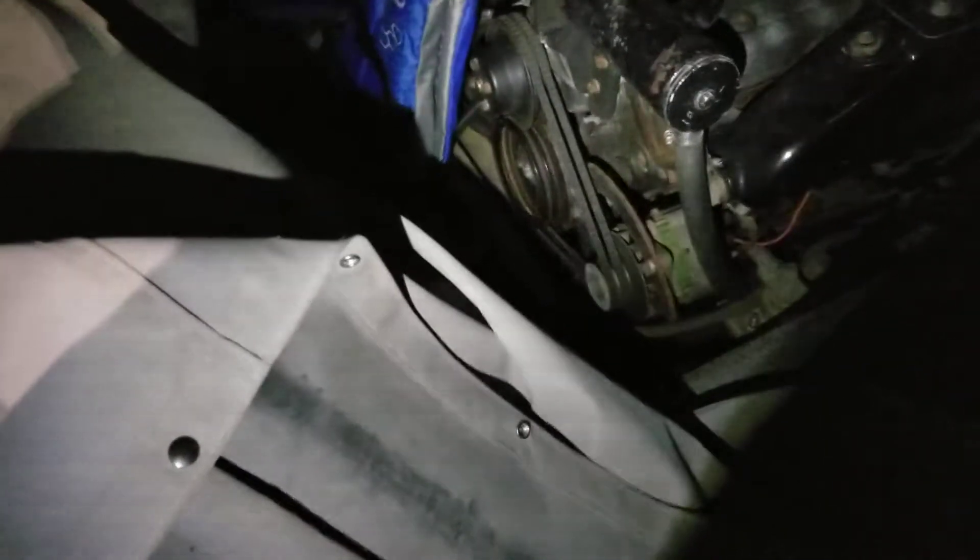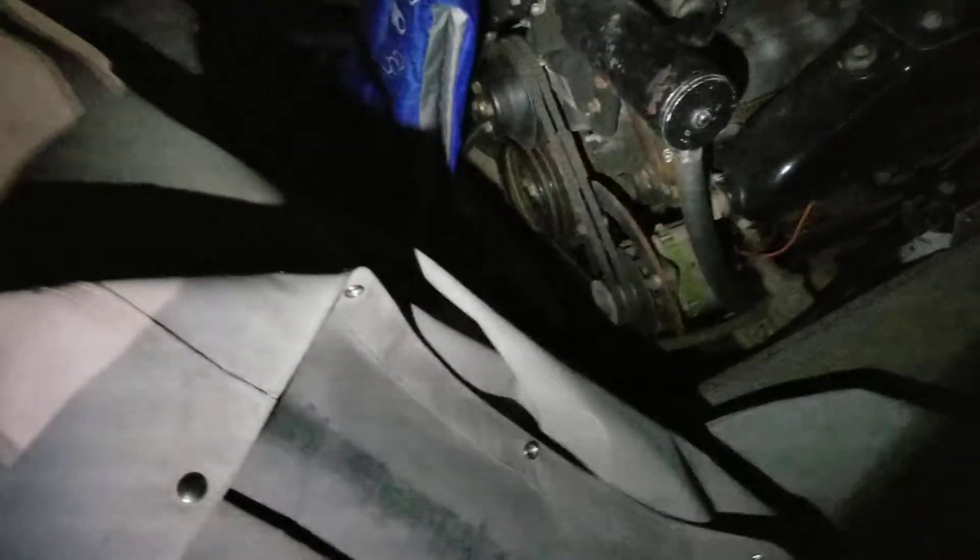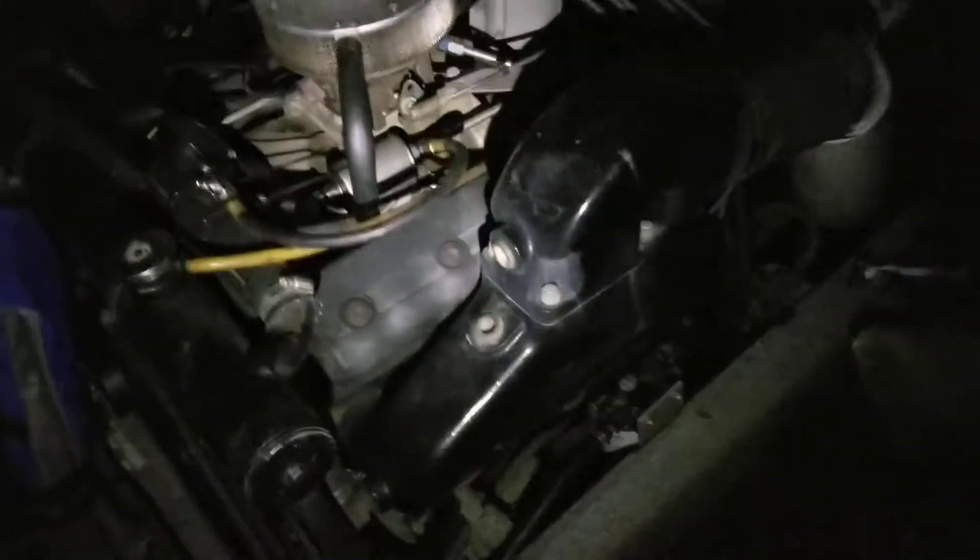Down here, storage and live well. The live well is fed by the main jet pump. Inboard, it's a Chevy 350 with Vortec heads. It's a roller motor, but it has all the old V-belt, double V-belt accessories instead of the serpentine. Water-cooled manifold, so it's got a closed cooling system with a log. It takes regular radiator fluid, dual batteries.